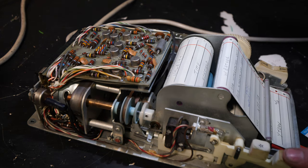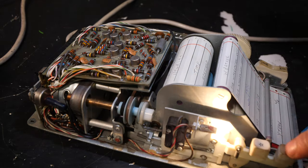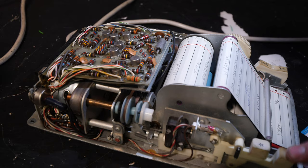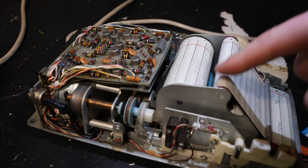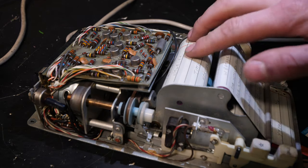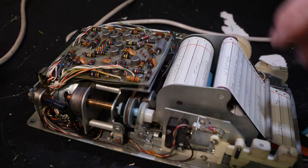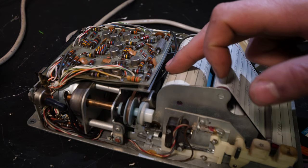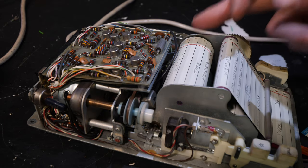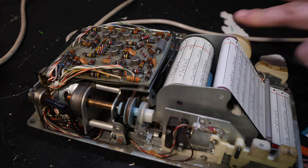So when you press call, it springs it back by loosening that piece of the cam off, which ends up bringing the springed belt back and brings the single tape head back, which is a record and write head that records and writes onto this paper, which isn't really paper. It's basically a fat tape. And as you can see, it's only run up to that point with only 4 numbers. That was near enough, so you could record a very long number if you really wanted to. It could be an international number and such that is recorded on here.